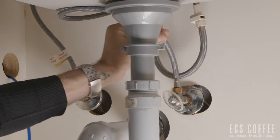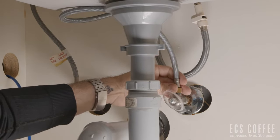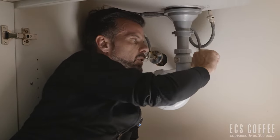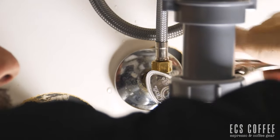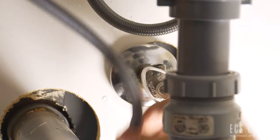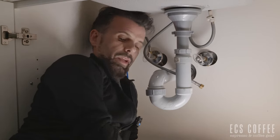If you have what looks like a brass or hard copper hose, you may want to call a plumber, because that's much harder and takes more skill. After you run the tap up top, the cold water should start to run dry because you've turned it off already. Then we're going to use a wrench and loosen this — I've pre-loosened it for the video. You'll get some dripping of water out of the line, not too much, and then you can get started.